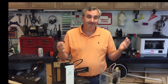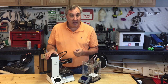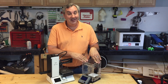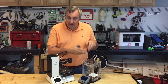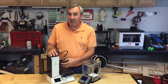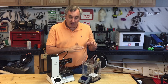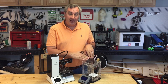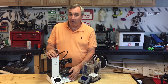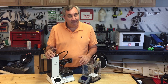So which one's better? The Select Mini has the bigger bed and a heated bed, so that's definitely an advantage. I love the heavy-duty metal construction. But if you're traveling around, the lightweight Fabricator Mini is very handy. I love the E3D V6-style hot end on it versus what's on the Select Mini — and many people have already changed the Select Mini to an E3D V6, so there are a lot of extra parts you can print to convert yours. I also like the open-source Marlin firmware running on the Fabricator Mini. The Select Mini's firmware I honestly don't know what it is, though it does have a 32-bit board which may have more capabilities. But right now they're about equal.